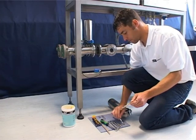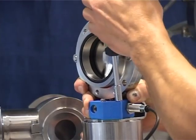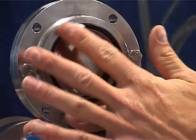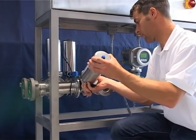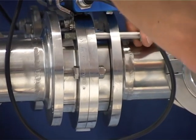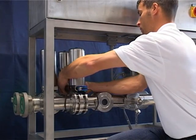First the bolt threads should be lubricated. Then mount the proximity switch bracket with the hexagonal screws that you disassembled when removing the butterfly valve from the small flanges. The proximity switches should not require adjustment but should be checked after assembly. Lubricate the two outside o-rings of the casing flange and insert the valve into the pipeline. Locate the valve position with the flange bolts and tighten. Finally the control air line can be reconnected to the actuator.